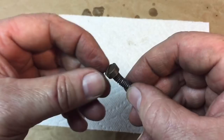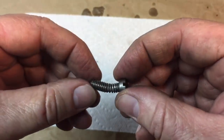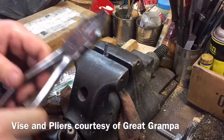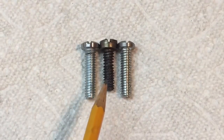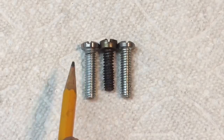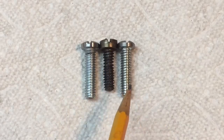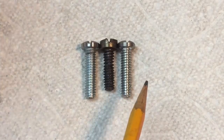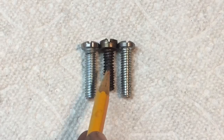Now we're actually going to do the job Tom asked us to do — heat it up and try to bend this back and see what happens. All the pressure is off because we have two of them made. We'd like to get the exact size from this one though, because I might have to cut the others down. Well, success — we were able to straighten it out, but I did feel a little bit of cracking. It just didn't feel right. Whenever you overstress a bolt like this — bent and then bent back — it's never a good idea to reuse it, because if it should break when screwed in, now you've got a second problem. A lot of old vehicles, head bolts that are constantly heated and cooled — they'll throw those bolts out and use brand new ones even if they look fine, because the metal has been stressed and overstressed. This one is no good to use. Tom, do not use this bolt.